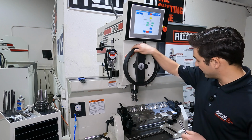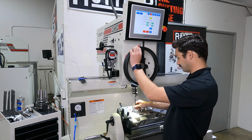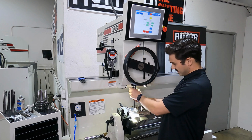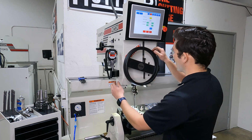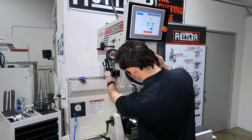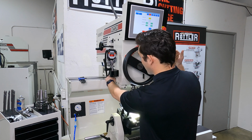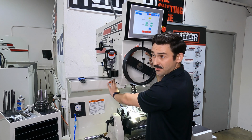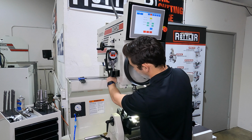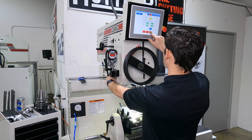So I'll put my pilot back in. We also have some lamps here we can turn on. I'll make sure this is engaged in with the holder. And now, for the best cutting, I always want to make sure that my work head isn't overhanging. It should be about centered of its travel. So I can put my thumb here, and where the edge of the top of the casting, this top float surface, and the base plate for the workhead, I just want to make sure those are about even.